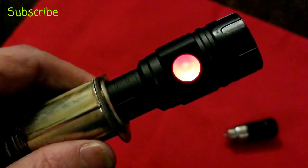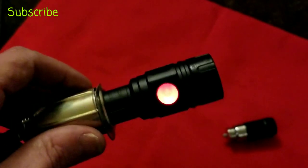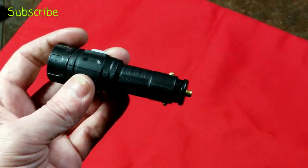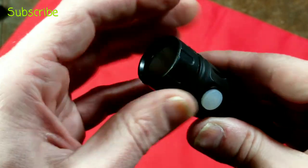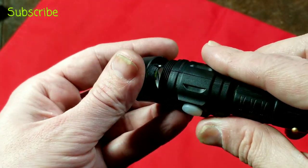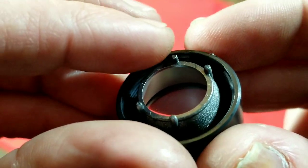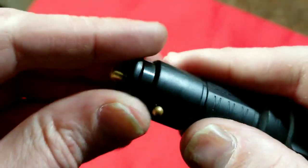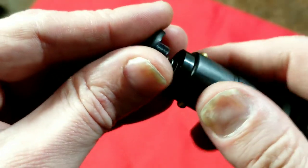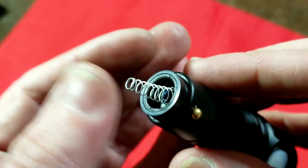One thing I couldn't find was the battery chemistry — whether it's nickel metal hydride or lithium ion. That would really indicate how worthy this little thing is. So let's open it up. It's surprisingly easy to pop open, which is nice — at least if you have issues you can re-solder a wire. The front cap unthreads and has a little plastic window that's potentially replaceable. Inside there's a chrome-plated plastic reflector with little pegs that fit into four holes in the circuit board. On the back side, this does not have a built-in fuse — it just has a spring, and the wire is soldered directly to it. That's the first place I'd check if you have issues.